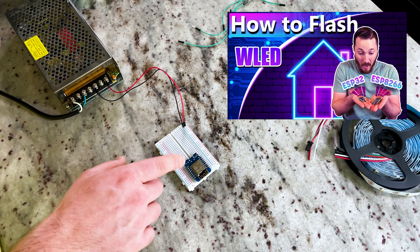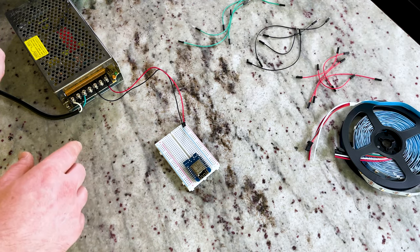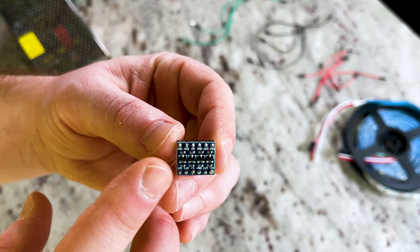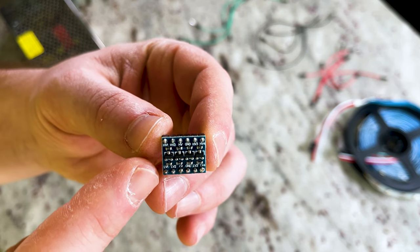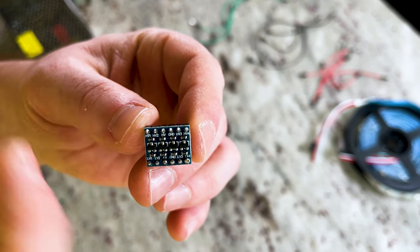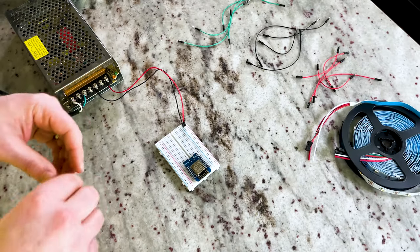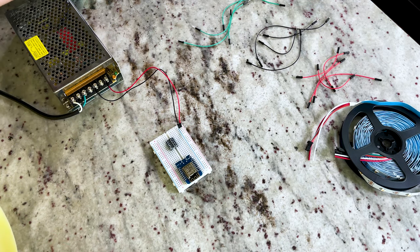We did have a video on how to do the flashing with WLED — it's quite simple, so if you don't know how to do that we'll provide that in the description below. Due to the distances my cabling is going to cover, we're going to be using a logic level shifter. It's got high voltage on the top — HV — and low voltage on the bottom. We need to provide a reference to that high voltage and a ground, and a reference to the low voltage and a ground, and then we can use any of the pins on the far left or far right to step that data signal from 3.3 volts to 5 volts.